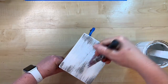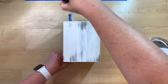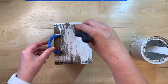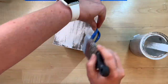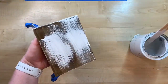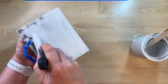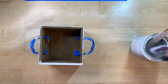I am currently out of my Waverly white chalk paint, so I decided to pull this out and use it. And I forgot how much I really do like this. So if you are looking for a new type and you haven't tried this, I highly recommend it. So I'm just going through here and giving this not even a full coat — it's just kind of sparsely putting it on. I'm letting the wood show through. We're wanting this to be very chippy and very weathered looking. But I'm going to do all sides, the rim around the top as well, and then I will also go down about an inch at the top so if you can see into it, you'll still see that white paint.